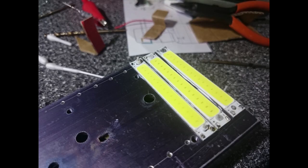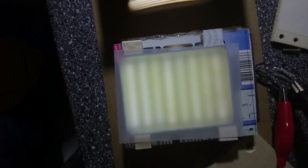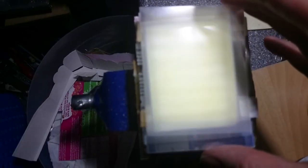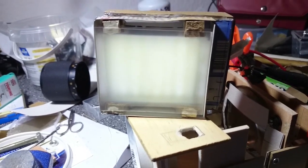I attached eight light strips to a large heatsink using plastic rivets that are made by heating up and pulling apart some Q-tips. A diffuser salvaged from a broken LCD screen evens the light a bit. I also found this kind of light guide sheet in another broken LCD which can center light beams that come in at an angle. In the right distance to the LED strips, the light guide makes the gaps between my lamps disappear.